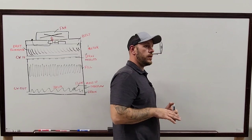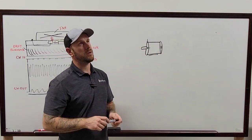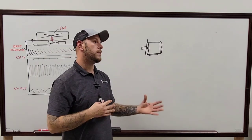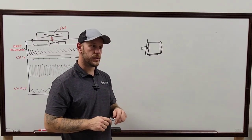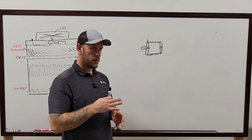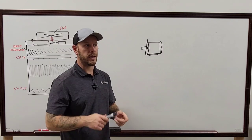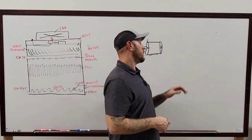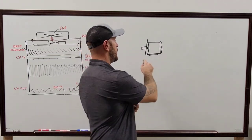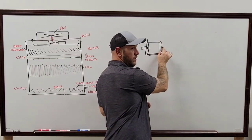On the equipment that we use, we go based off of IPS. On the IPS settings, once you get to, I believe, 0.1, you're in the realm of caution. You're starting to pick up slight vibrations coming from bearings, shaft, alignment, or pulley. You have to determine which one of those is doing it, for instance by taking the load off. On the motor, you'll be doing vertical and horizontal on each bearing, front and back, which gives you 4 points. Then you'll have axial, which gives you your 5th point.